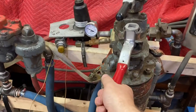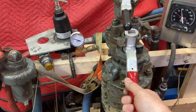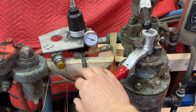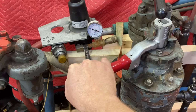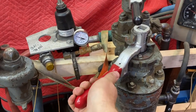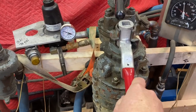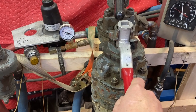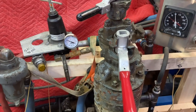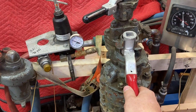The positions on the 14EL system, if you're not familiar: you have release, or running — actually it releases over here — and it's release and charging; you charge in the running position as well. You have holding, which I'll go through in a minute. I'll show you lap and application. Being this is a lap valve means you have to bring it back to lap regardless of what you're doing with it.